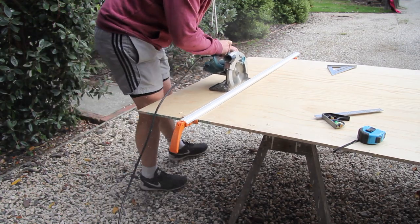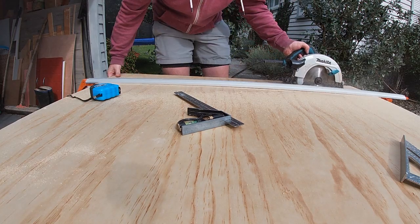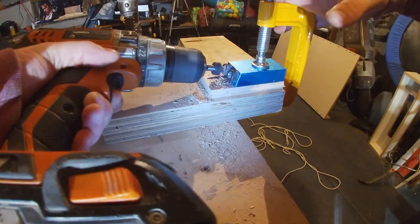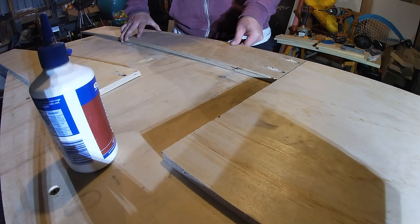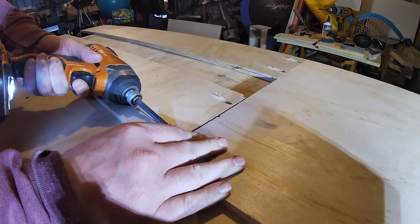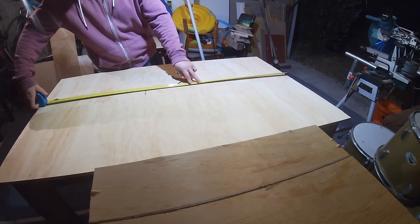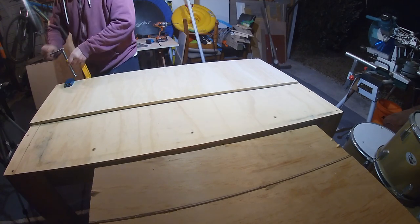I started off with cutting strips of plywood. Now I don't own a table saw, so it was a skill saw and a straight edge for me. It worked for the most part. I think quite soon I'll be buying myself a table saw, but that will come in time. I'm using 12mm plywood and joining it together with pocket holes. I'd started off the base in a few different strips joined together with a bit of dead space. I'd done that because I thought it might save a bit of weight, but the reality being it's only 12mm plywood — it wasn't really an issue and if I had my time again I wouldn't have wasted my time with it.